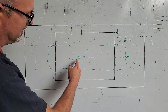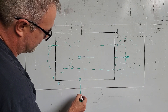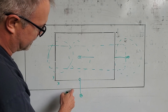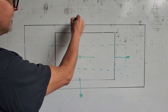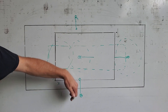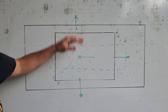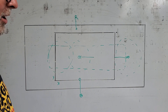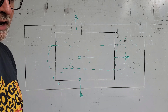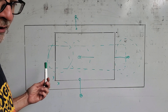The same goes for the Y axis. If I need to machine way on the front edge of the part, I can put the spindle here, offset it 4 inches, and come outboard of the main table by about 2 inches and inboard by about 2 inches using the 90-degree points on the head. I've done this trick a little bit in the past along the Y axis but not the X axis — I will be resurfacing some cylinder heads in the near future and I'm going to make a big 8-inch fly cutter to do a pass in essentially one setup without having to break it down and move it on the table.